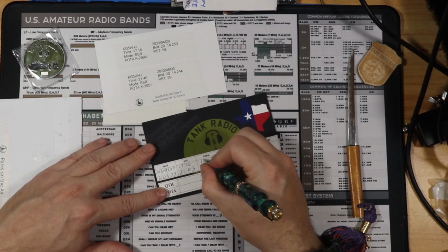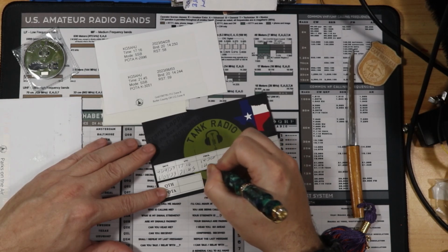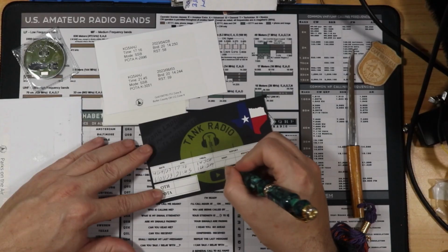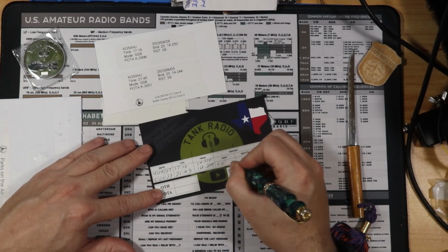So if you do it that way, then it's going to be coming into the house. So if you get a close lightning strike, or God forbid a lightning strike, you don't want all that electricity and sparks coming into the house. That's why we have lightning arresters. That's why we have grounding plates that drive everything to the grounding rod system. So all that's buried underground now and connected to the house ground, so it's all in the same ground potential, and that's what you want.